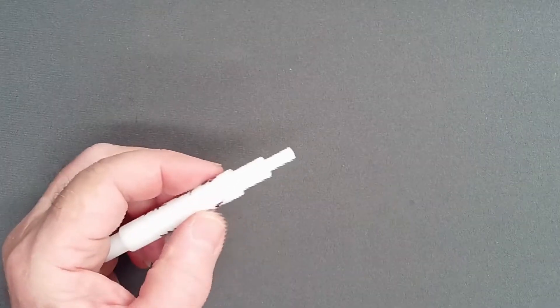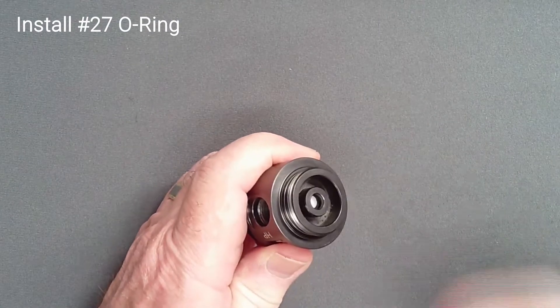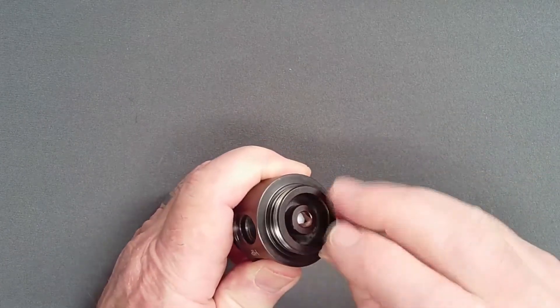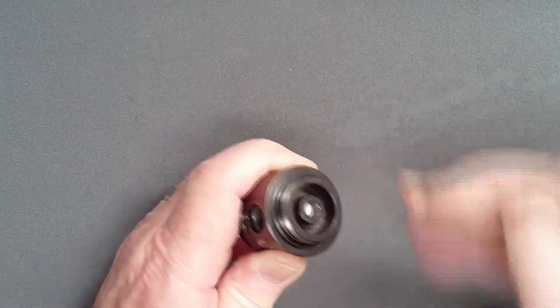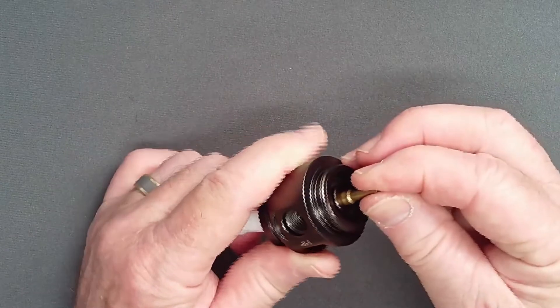Using the bushing tool to provide a floor for insertion, install a lubricated stiff O-ring number 27 into its land in the end cap side of the body. Use a thin wooden dowel or a brass spade to work the O-ring into the land. Then insert and remove a lightly lubricated piston bullet to ensure that the O-ring is properly seated.